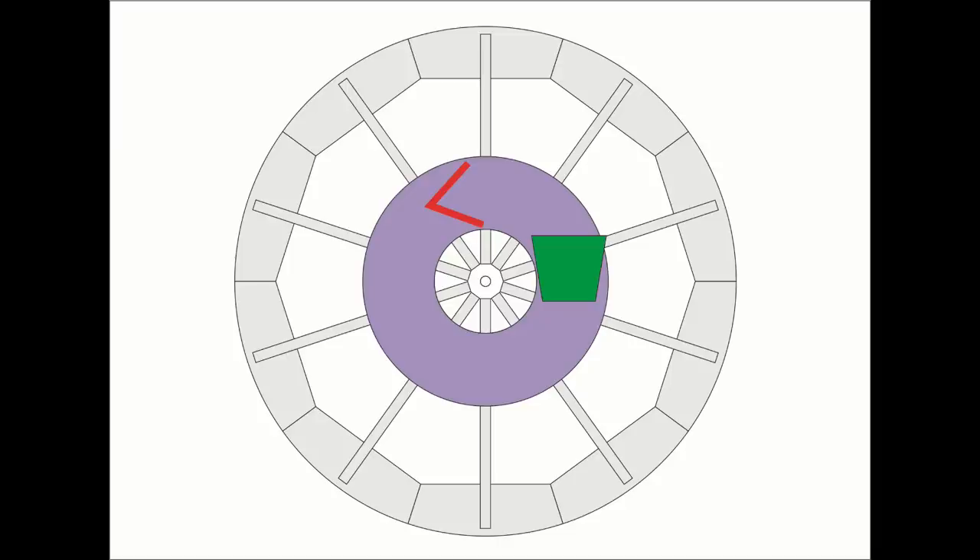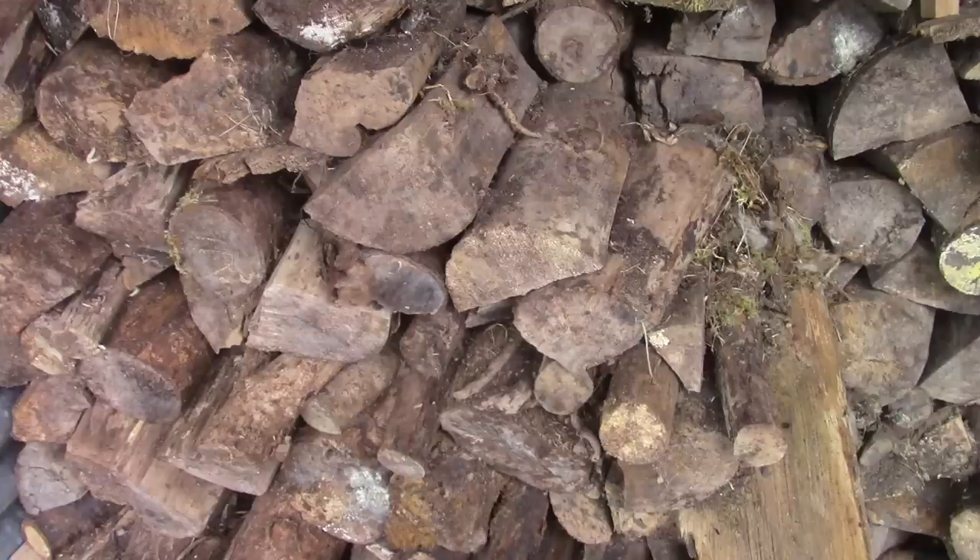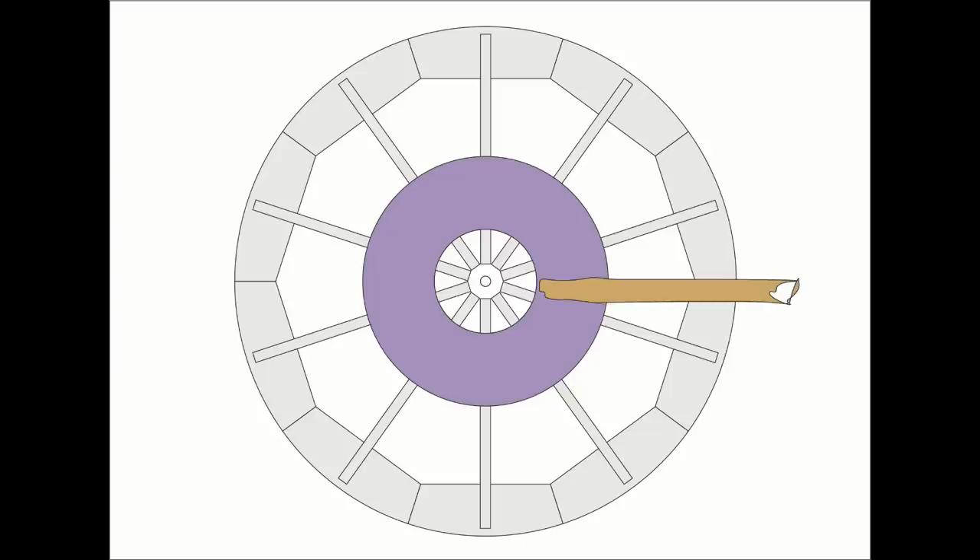Simple, and I'm sure it would still work, but before I even got that far, while making the wheel, I realized how powerful it was likely to be. So I expanded the plan to include breaking up logs too - not just the charcoal. Breaking up logs using teeth on the spokes. My aim is to reduce logs to the size of kindling so they'll dry easily and I can make them into charcoal. I don't want really small pieces because they're too difficult to dry before they turn into compost, and I don't want big logs because they take too long to dry and cook. So I was thinking that a few short teeth might rip the log into fibrous lumps and do it quickly.